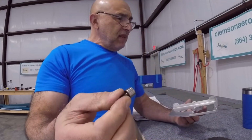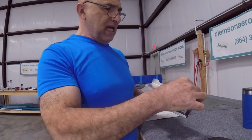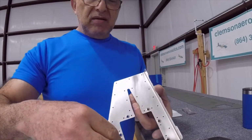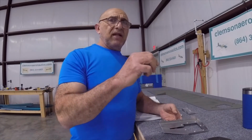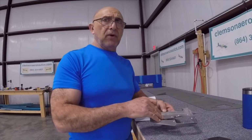Actually, same thing when it comes to the holes that's close to the edge. Maybe not this one. This one is very close if you look at it. Watch out for this big one, guys. Use the reduced female dimple die on the number 40 holes.